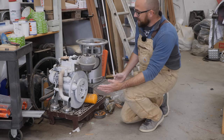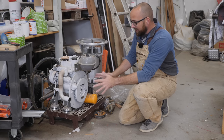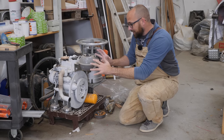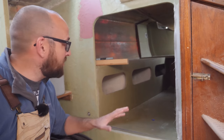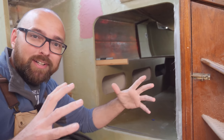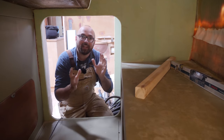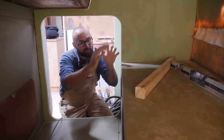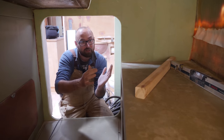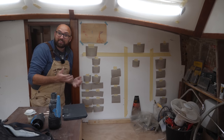This right here is my DIY diesel generator. I'm waiting for a very specific flywheel housing that'll allow me to mount this alternator in line with the engine. Unfortunately it's going to be a few months until it shows up, but when it does the generator is going to be kind of long and narrow. My plan is to install the generator up here on this old bunk in the technical compartment, but to fit the shape of the generator a little bit better I'm going to lower a section of the old bunk. The installation is going to be a bit of a compromise because I'd like to have that weight down as low as possible, but I can't lower the bunk too much because of the curvature of the hull — it would get very narrow and I wouldn't be able to fit the generator.